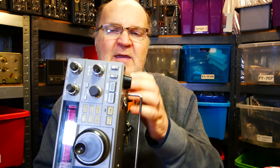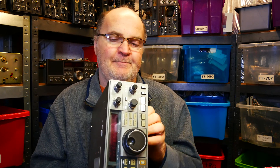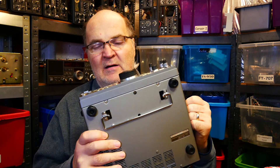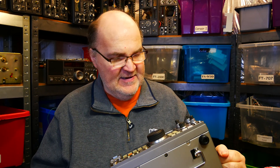I also have a halo loop, but more on that later. You can also get the sister transceiver — the TS-811, which is the 70cm model. I haven't got one at the moment, but I'm trying to get one. They look good side by side and you can combine them and use them on amateur radio satellites, or just use single sideband. I also use the TS-711 as an IF for 23cm — I bought a 23cm transverter and this transceiver is ideal for that.